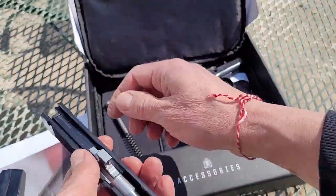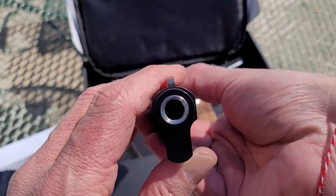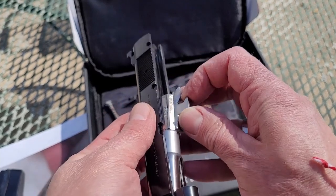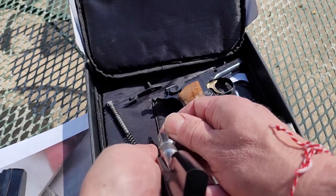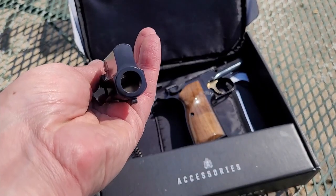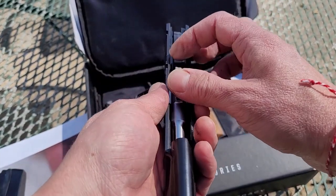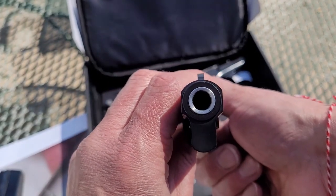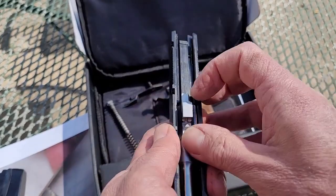We call it the eighth wonder of the world because along with having that type of relationship when the barrel is parallel to the slide — or horizontal — it also must be able to unlock and tilt during cycling, and then finally it needs to be able to come out at an angle and go in at an angle. So this bushing inside here, all the way around, is just a brutal kind of angle to machine perfectly and to do well. This is one place where, at least in the pistols that we've tested, it seems like the Springfields, especially with the BH Advanced Barrel, have a very impressive relationship with the barrel.